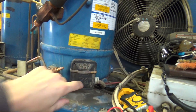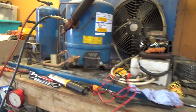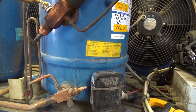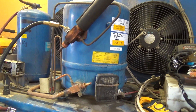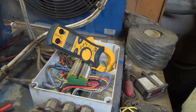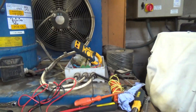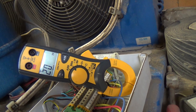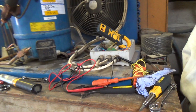Just checked the windings have reset, so we're going to try and pump it down. Hopefully it'll run. Just humming. I think we just had a hum then — that's not good. She might have seized up. We've swapped a couple of phases so it'll try and run the other way to free it up, and we've got a clamp meter on one of the legs. I've got an open — the overload might have gone off again.